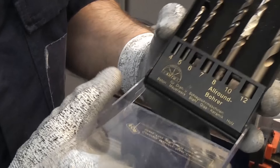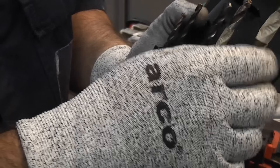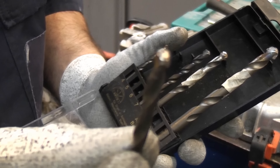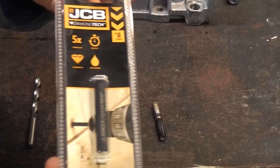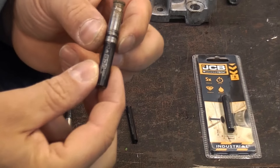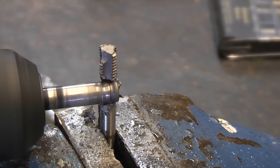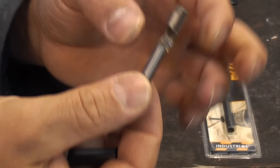You could use these — they are made by R2 and are multi-purpose drill bits that will drill virtually anything, but as you can see a few of these are seriously battered, especially the size I need which is about five or six mil. So the tool we're going to use is a JCB Diamond Tech hole saw, impregnated with diamonds on the end. I've previously used one to drill 60 holes in a granite tile and also to drill through a broken tap in a vice.